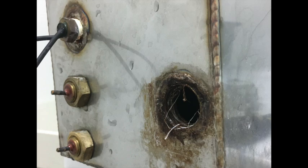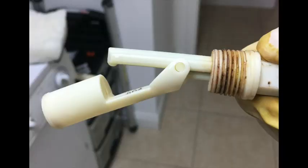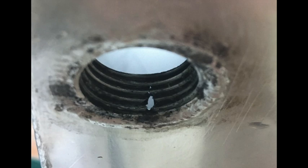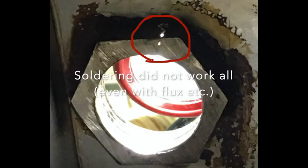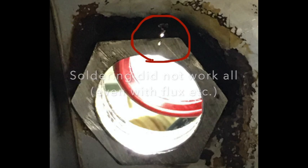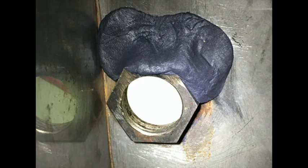I unthreaded the float switch to check it. The threads are not very good. The float switch works by making contact when this magnetic floating device floats. Here's the inside of the unit where it fits, and I noticed there's actually a bad thread — you can see a pinhole here, actually more than a pinhole — that needed to be sealed. You can see the light going through it, so I used JB Weld epoxy putty to seal it.